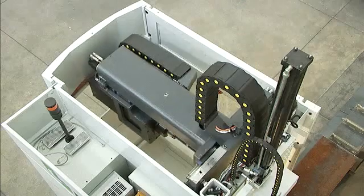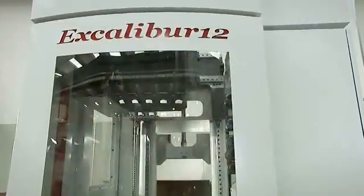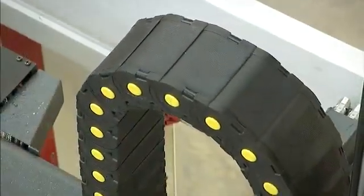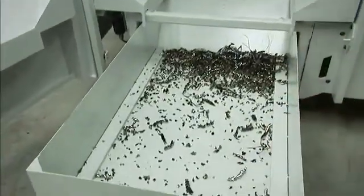The concept of the Excalibur 12 starts with a self-contained system that is cantilevered off the material storage table. The protected cable carrier design eliminates the potential for drill chips — not contained by our enclosed structure — from cutting the insulation on any trailing wires.